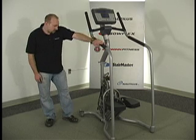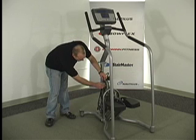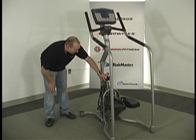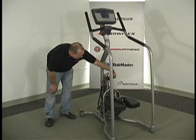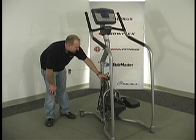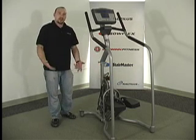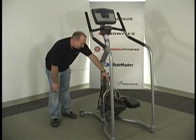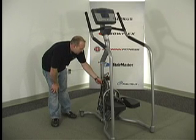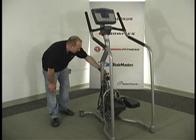If you do all those tests and you rule out the battery, you want to take a look at your speed sensor. Make sure that it's a business card's thickness from the speed disc. If that's the case, then you should be able to verify that it's working properly by measuring the AC voltage in this. Now, any of these tests that I mentioned have been discussed in previous chapters. So if you want a more in-depth description, you can refer back to those sections. So once we verify that we're getting 3 volts AC off of our speed sensor, we can rule this out, and we can take a look at our load resistor.